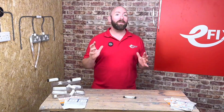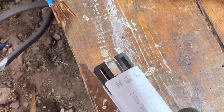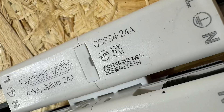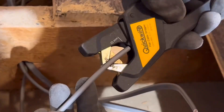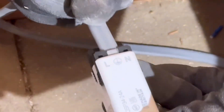The clips have notches in them which fit into the Quickwire junction box perfectly, making it really secure. It's a really small and slim unit so even in the tightest of spaces this junction box is going to fit, and if you do need to remove the cable you can with this neat little tool which slides in here and pops the cable out really easily. Back into the bedroom to connect the spur, and this time I'm going to be using the four-way splitter. Breaking into the ring again we connect the ring legs into the Quickwire four-way, and flipping it over we can connect the spur into the splitter.